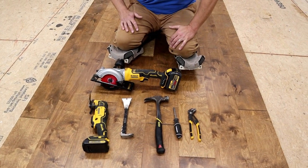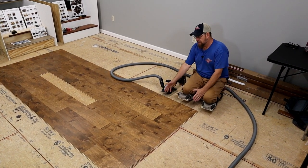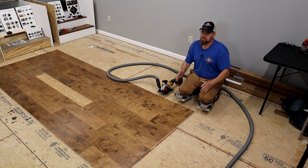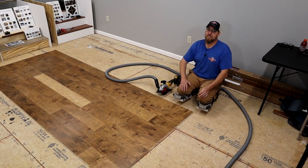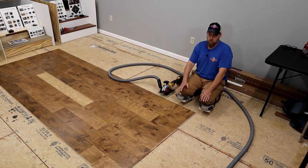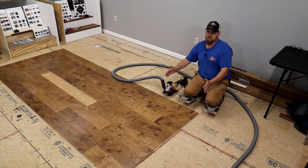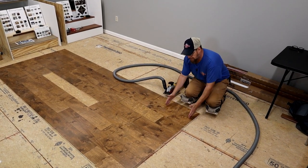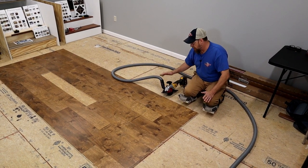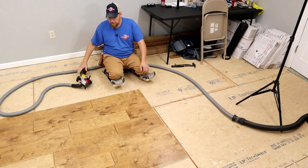Whenever we get started here, if you take this up in full planks it's going to be pretty rough, because the staple pattern is going to be every three to six inches if a person stapled it down properly. So every few inches there's going to be a staple in the tongue of these boards, which makes it pretty hard. What I'll do is cut across the rows in this direction, making cuts every eight inches to a foot, so I'm dealing with small pieces instead of whole boards. It makes it come up so much easier.